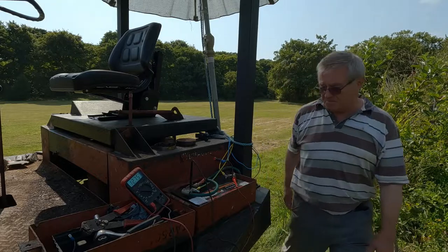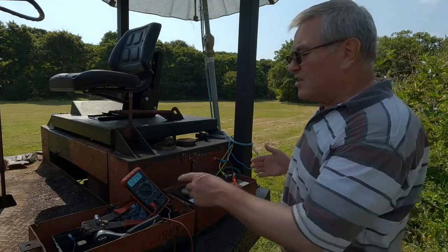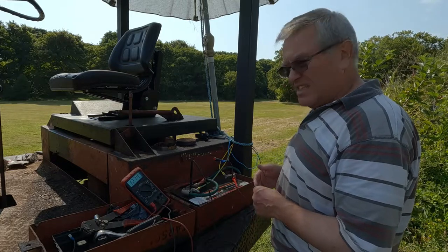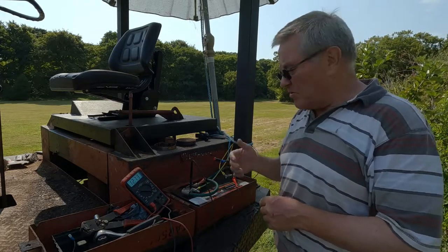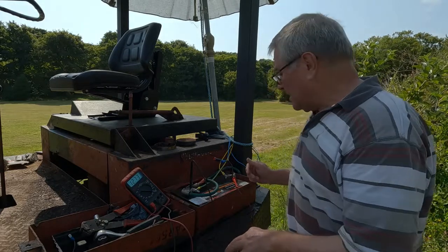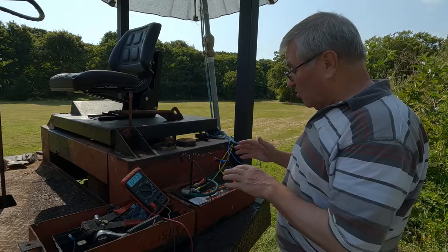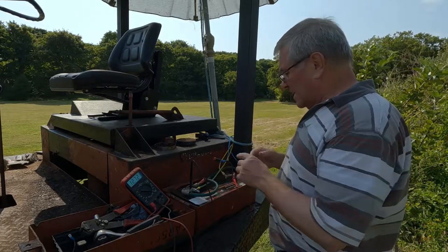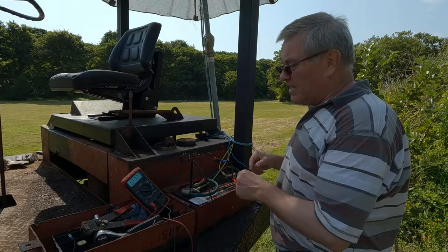I'm not sure if you can see it or not, but I was getting it earlier, I was getting a reading of 14 volts across there when I revved it. I think he's got an injector gone, so it's a bit smoky, ignore all that. That'll be the next problem I'm coming to. Anyway, this seems to have resolved where the issue is, so I'm hoping I can take all these extra wires off now and just mess around and rewire that in somehow.